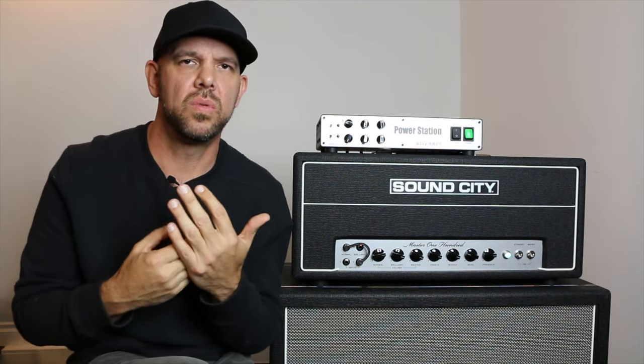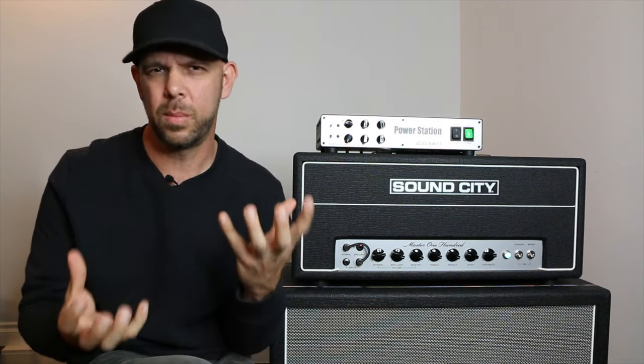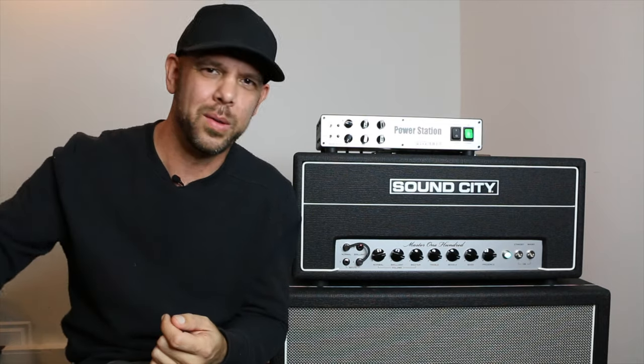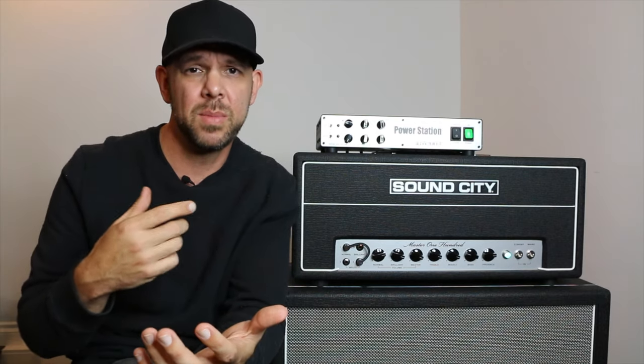So what's a ground loop? A ground loop is an issue that crops up when you have devices or an audio ecosystem that sees more than one path to ground. If you have two or more pieces of gear connected to a common ground via different paths, both pieces of gear are jockeying and competing to determine which one is going to be ground. In a guitar rig we're using unbalanced connections, and unbalanced cabling also uses the ground for audio information. So when ground loop stuff is occurring, the ground conductor is not only serving as ground but also carrying hum and noise caused by power flowing through it. This loop manifests in audible form as a low-frequency hum — sometimes a 60-cycle hum — and sometimes a high-pitched squeal when you connect your effects pedals to your rig.